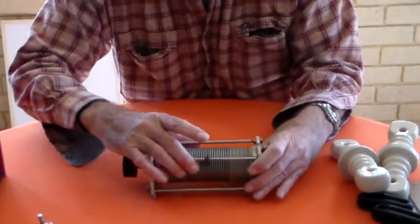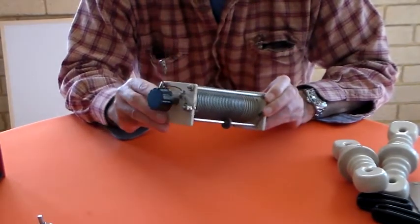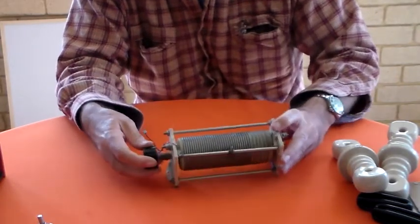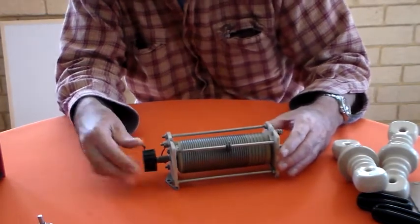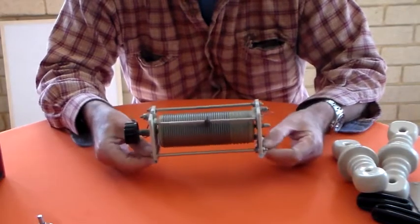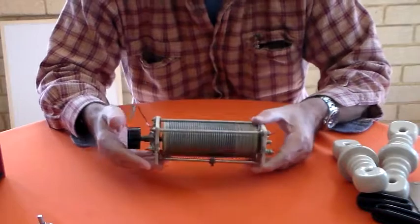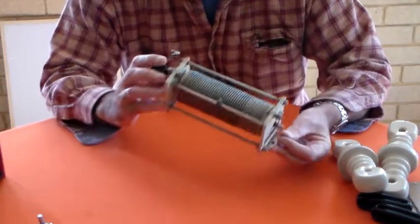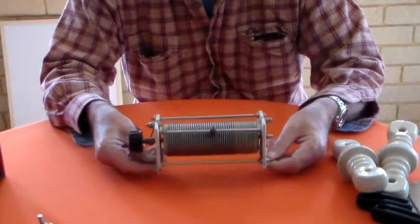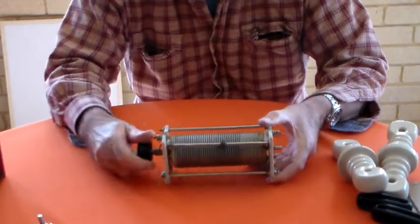Just a quick note on this roller inductor — it's already got a very nice shaft coupler, and the shaft on the knob side is already decoupled from the RF. So I can bolt it into a box, drill a hole, have the shaft sticking through as long as the coupler isn't touching the box, and mount it on some insulators. I've got some nice stud insulators — probably about an inch long — so the inductor would sit on those and the shaft would go through the box for my rather nice L-match.